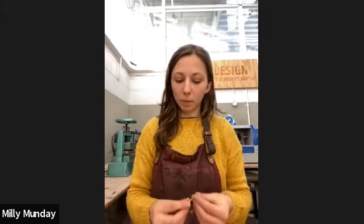Because if it's not touching, then what you'll have to do is get in there with a scalpel and make sure that you've got that funnel through so that the wax is able to reach the model. And cutting the vulcanized rubber is quite a bit harder than cutting silicone. So it's worth pointing out, when you are setting it out in that sandwich section, when you've got your funnel and your sprue and your model, take the time to make sure that it's in place and all touching.